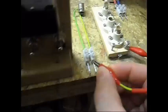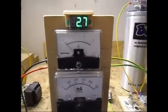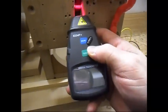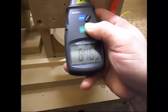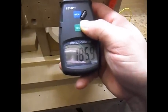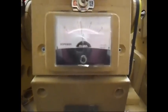Now I'm going for the 5-watt load — it's barely lit up, just slightly. At 2.7 volts DC at 160 milliamps. RPM is now 1860. Input is 29.4 at still roughly the same 1.2 amps input.